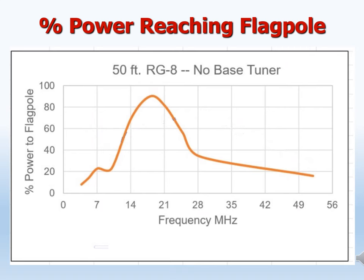The flagpole itself is an efficient radiator of RF, but if one feeds it from a tuner in the shack through coax connected directly to it, SWR loss in the coax will be unacceptable in most cases. Here's another look at this issue for 50 feet of RG-8 with no tuner at the base. Only as a compromise on 20, 17, and 15 meters might a base tuner not be essential. Closer to the natural resonant frequency of the antenna — roughly 18 MHz — the loss is somewhat more modest, but on the other bands it is severe. This data should be taken only as a rough guide, as individual surroundings can easily make a big difference.